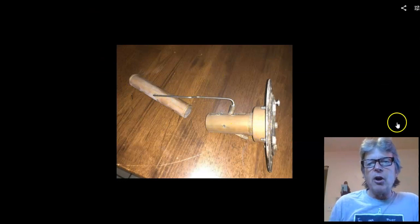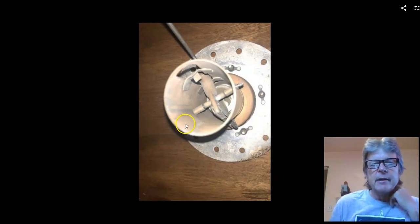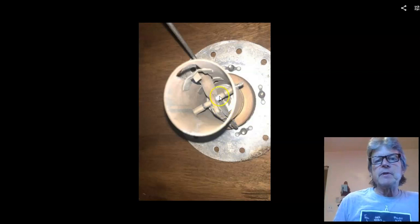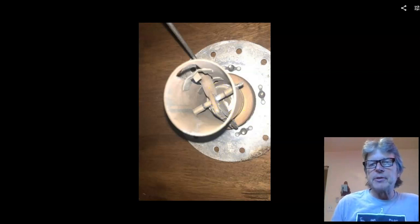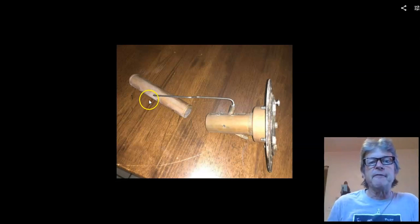Now down inside this arm, there is some mechanical controls, looks like this, and it moves a resistor. There's an arm and there's a resistor circuit built into this, and so as this moves, it changes the resistance. The electrical system measures the resistance. A wire comes out of this side and goes up to the cockpit, and that gives us a cockpit indication. So the way this works is it's a float, and it is mechanically actuated and through electricity delivers a signal to the cockpit.